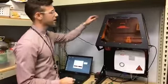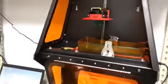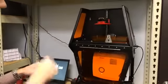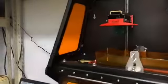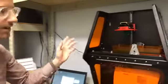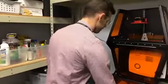Back here we have our 3D wax printer — this is the V9 Creator. In here we have our light-sensitive liquid material. The projector down here splits the ring into about a thousand different tiny layers and projects those layers of light, which cure in this green liquid. This arm raises up as it's being printed, and the model grows coming out of that liquid. They come out dirty, so I clean them up in some denatured alcohol and then clip off the little supports with clippers.